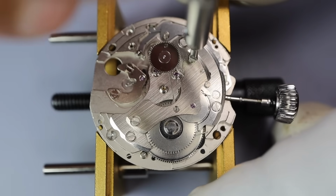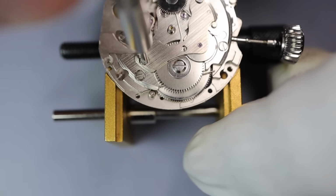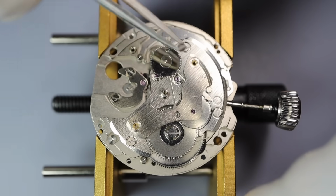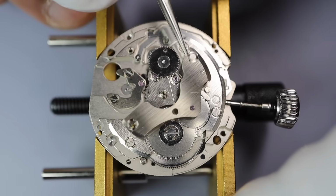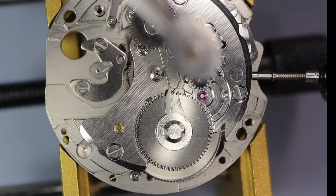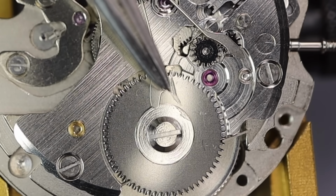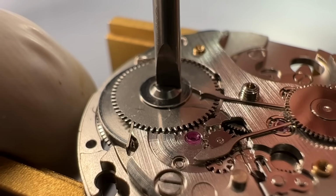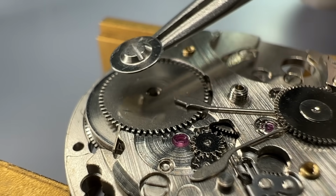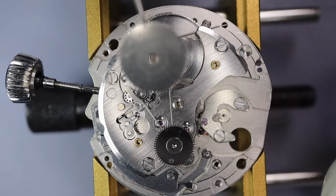So on this side, we'll start off with the automatic train bridge. So this caliber is a 4R57A, which first appeared in Seikos in 2016, but the 4R family range has been around since 2008. The second reduction wheel, nice amount of juice on that. Look at all that. And now that ratchet wheel screw can come off. So this is a 29 jewel automatic with a power reserve indicator and a pointer date, and is also sold to micro brands and the modding community as the NE57.